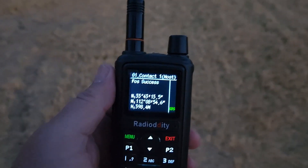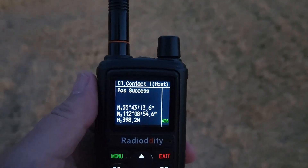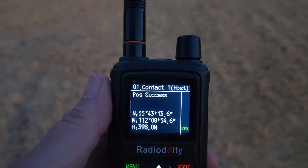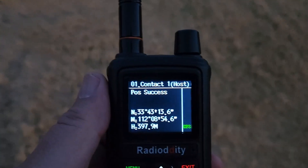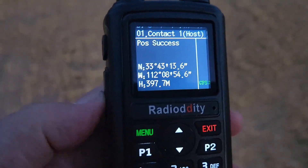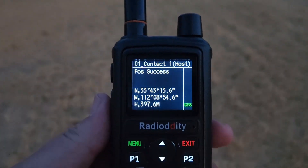You can see here that the 'my place' position on both of these are really pretty close — 12.8 on one and 12.7 on the other, 51.1 and 51.1. So these two are reflecting the same position. I'm going to go down to the other end of this area to generate some distance between the two radios, leave one here and take the other with me, then transmit my position to the stationary radio and request the position of the radio left here. This radio is 101, contact one is the host, and the radio up by where that guy's walking his dog is radio number 102. I'm at 13.6 and 54.6.